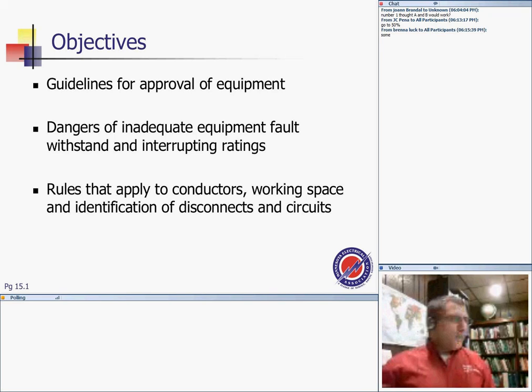So, moving on, guys, from boxes, device boxes, J boxes, pole boxes, into electrical installation. Article 110 is very interesting, so I have a few things to cover tonight. In Article 110, guys, we're going to cover dedicated space and working space around electrical equipment. We're going to cover approval of equipment, listing, labeling, voltages, and a couple of other really interesting requirements. We're going to go to manholes and touch on tunnels where they have high voltage systems. We have a big plan for the night, guys.